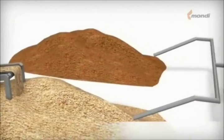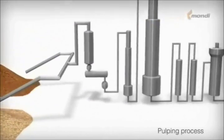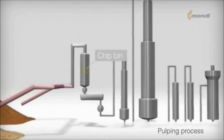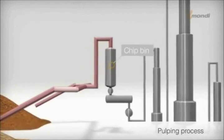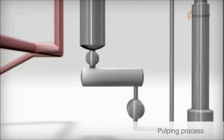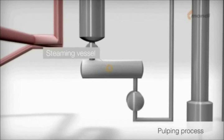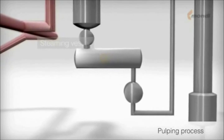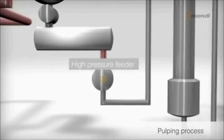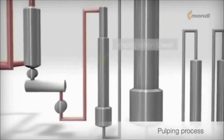The primary task of the pulping process is to separate the fibers by using cooking chemicals. Here is a continuous sulfate process beginning with the chips from the wood yard entering the system at the chip bin. Chips then enter the low pressure steaming vessel where they are preheated with steam to remove trapped air inside the chips. The chips are then pressurized by the high pressure feeder and impregnated with white liquor in the impregnation tower, which penetrates into the capillary structure of the chips.